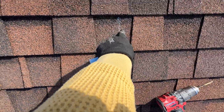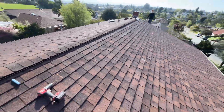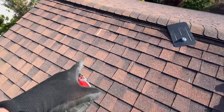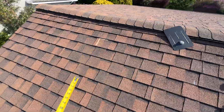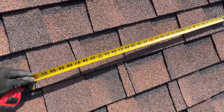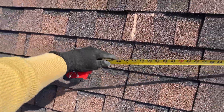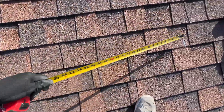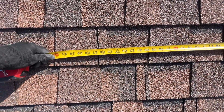In this case, we got right into the rafter. Now we are at the end of the row — we started right there and now we're here. We want to find the rafter as close as possible to the edge. In our case, it's going to be at 24 inches right here, and the next 24 is going out of the panels. So that one is going to be our last L-foot mount right here at 24.